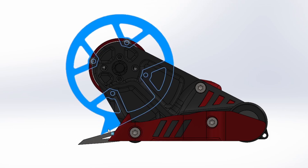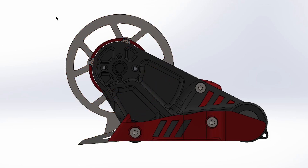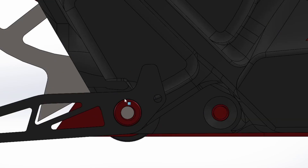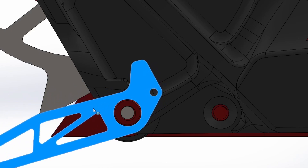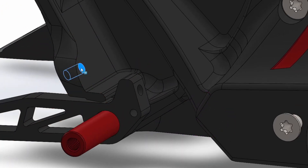The main cause of the issues is the forks. For starters, they're a little bit too short. The first thing I did was lengthen these to help counteract the torque reaction force. I next added end stops to the forks to limit their range of travel so they couldn't get stuck under the robot. I also added a hole through the back of the fork and through the chassis that I could put a piece of elastic through to help tension the forks down and keep the tips in contact with the floor.